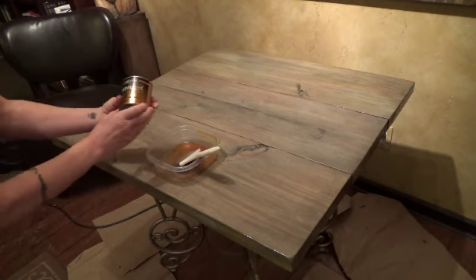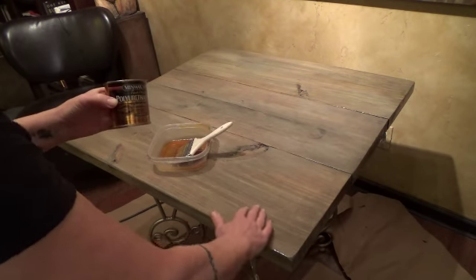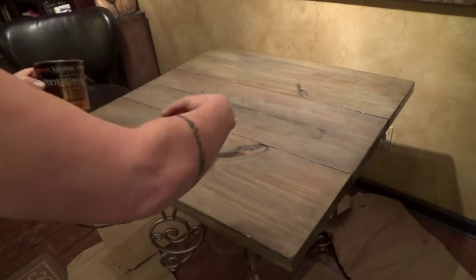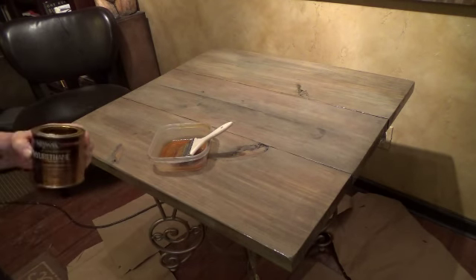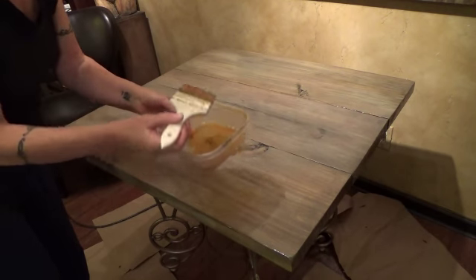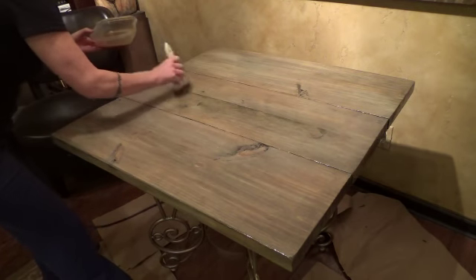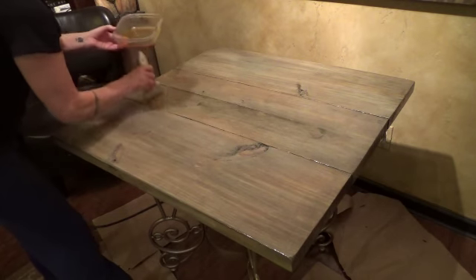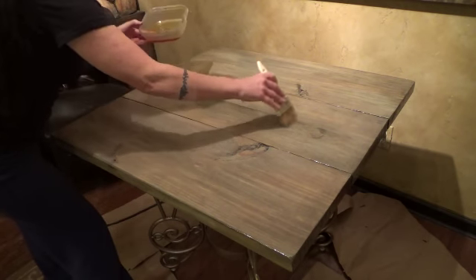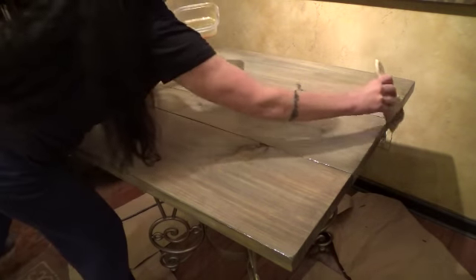Top coat time — I'm just using oil-based polyurethane. Because we're going to have food and drink, water, heat, hot plates — I just think we need oil-based for durability. I'm using a new chip brush, not the old one that has water on it. If you roll your sealant on, it's going to bubble — you do not ever roll sealant on. You work it back and forth, working it into the substrate. I like that amber hue on there; it just has such a nice warm glow.